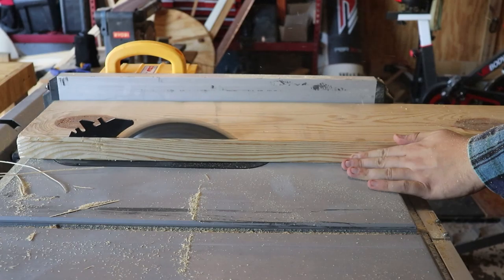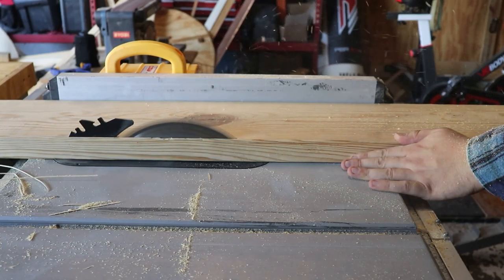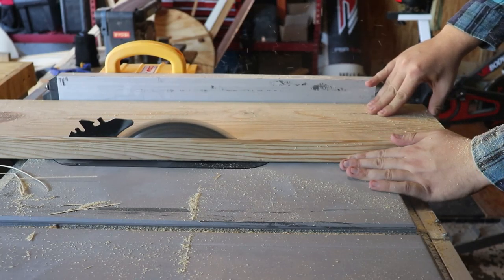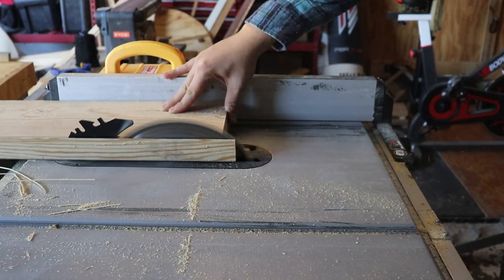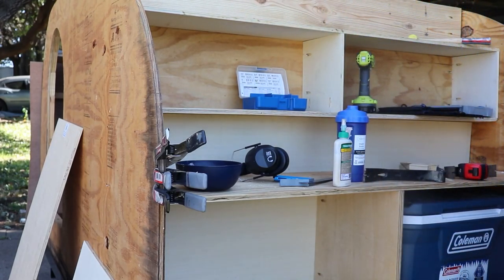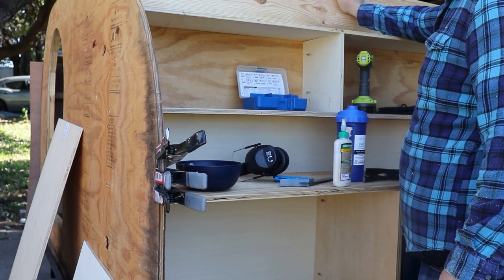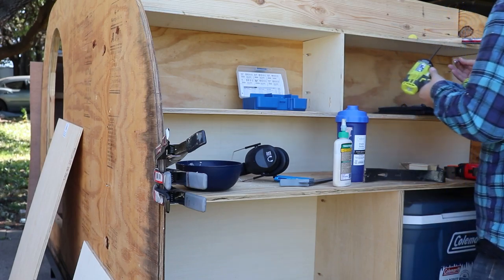This is just regular pine, but because it's so thick it does take a little bit to cut through, so you do see me go pretty slow here. This is a whole lot faster than trying to do this with a handsaw, and if I tried to do this with a circular saw I might as well just create waves. So once it was cut down to size, I got the holes pre-drilled in. I'm using pocket hole screws to keep it in place and just drilled it in. It was a bit of a pain to manage — I used a little crowbar just to push it and move it into where I needed it to go. But once it was in place, it's not moving, and I like the fact that it's really added some massive stability to the camper.